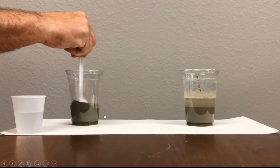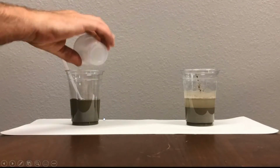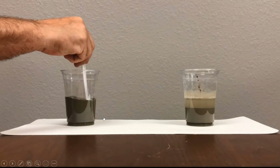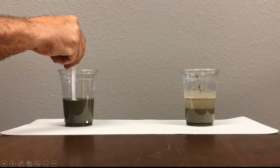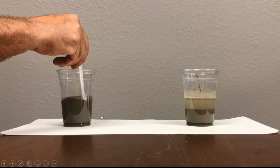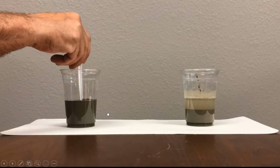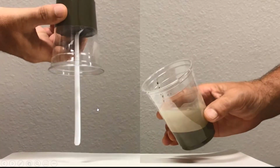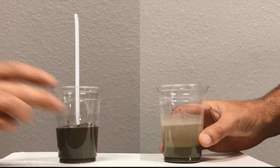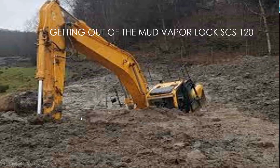Yeah, Scott, this demonstration, so no one is alarmed, is a 600 times overdose of whatever we would put in the back of a concrete truck. This is just overdose to speed up and show you what's actually happening here. We're converting calcium hydroxide back into CSH, or calcium silicate hydrate gel, which is the building block of concrete. We are completely eliminating the bleed channels. Right. And this is the same chemistry that's employed by fly ash and slag in concrete, but it all reacts with the cement in the soil in the same way.